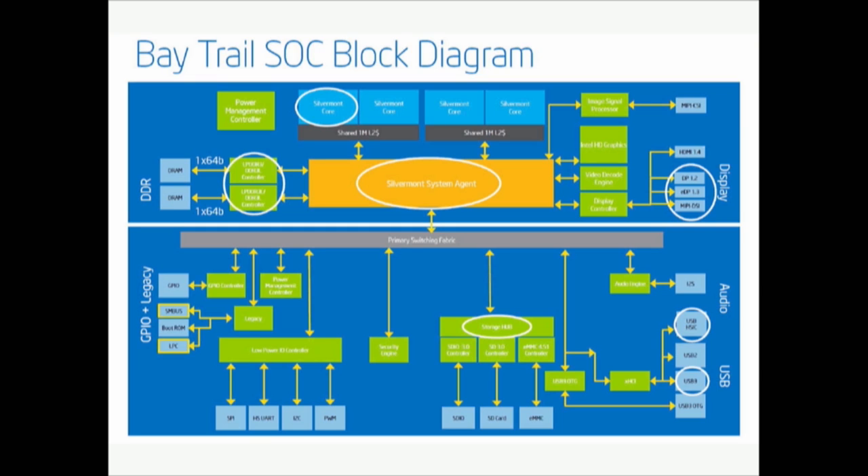You don't always see ARM stuff on an SOC. This is from a Bay Trail SOC that goes into a laptop. As you can see, there's an old SM bus and what looks to be boot ROM and legacy stuff to hold all of the old x86 stuff that has been sitting there withering away in a corner because nobody runs 32-bit x86 anymore, right?